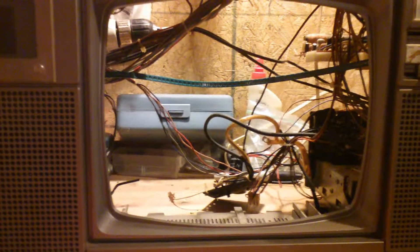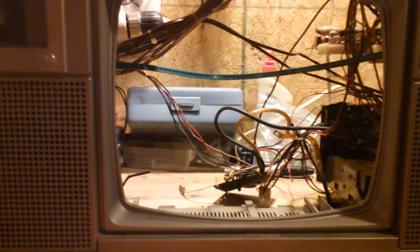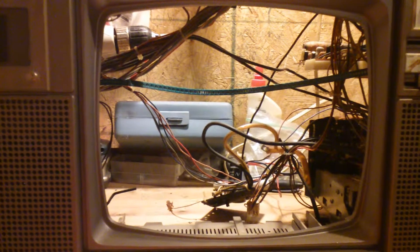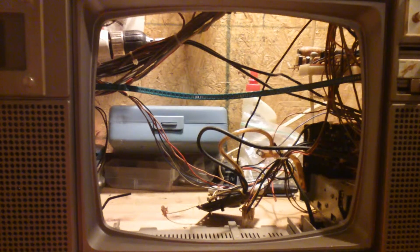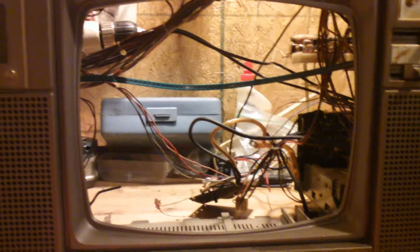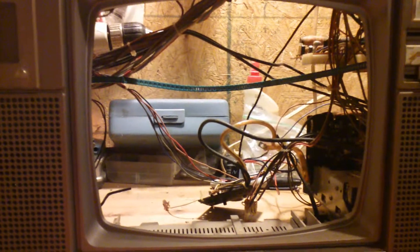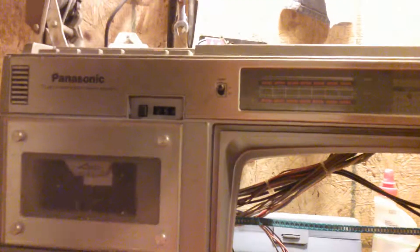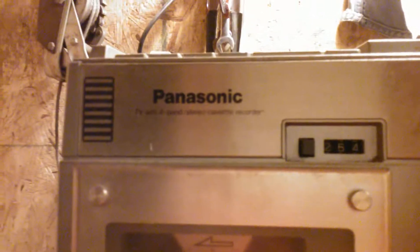Anyway, if you have one of these and you want to take the TV chassis out, just remember there's a zener diode and a capacitor on that board where the power leads are wire-wrapped to it. You need to pull those and connect them up somewhere inside the radio, otherwise you're not getting power anywhere. This project is somewhat out of the way - I'm not going to do a serious rebuild, I'm mostly just trying to get it working so others can use it without worrying. I'm going to clear off some space, hook a shortwave antenna up to it, and find out what it'll pick up tonight. I promise I'll get the video of my long wire antenna up sometime - take care.